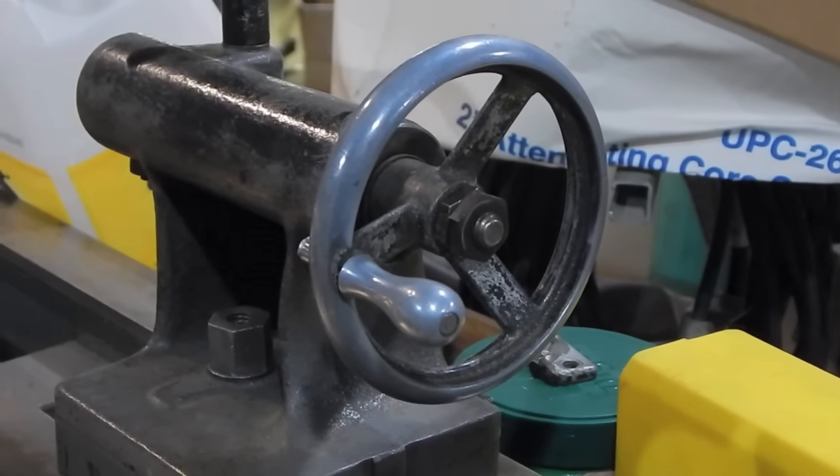It made me think — is this out of round? But it's not — I just checked. This is like half a thousandth under three inches, and turning it this way it's a thousandth under. So I'm getting a pretty consistent measurement within half a thousandth no matter which way I go around, which tells me this thing is perfectly round.